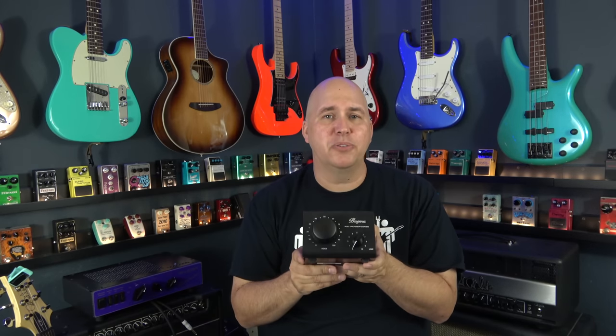The first thing to note about a passive amp attenuator is that it doesn't require any power — no wall warts or power supplies needed. You just need an extra speaker cable to plug this into a combo amp: take the lead that comes off the speaker, plug it into the back of this unit, and it goes between your amp and the speaker. This allows you to turn the amplifier up as loud as you'd like to get the sound you love — maybe it's too loud for the stage, at home, or recording — and use this to adjust how much of that volume actually makes it to the speaker, so you can have your amp cranked at bedroom levels.